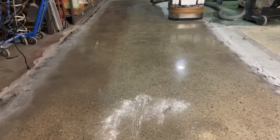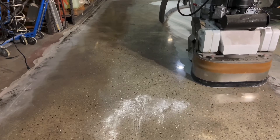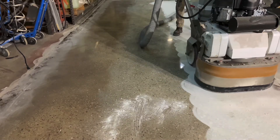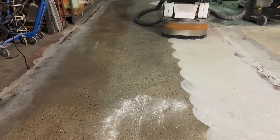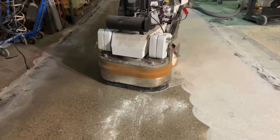Deglazing a diamond tool is really just a matter of abrading the surface of the diamond so that the individual crystals will resharpen. On a hard surface such as this one which was previously polished, the diamonds start out cutting pretty well making dust. You can tell that the diamonds are actually doing something, but by the second pass it's pretty clear that they're not cutting nearly as much.